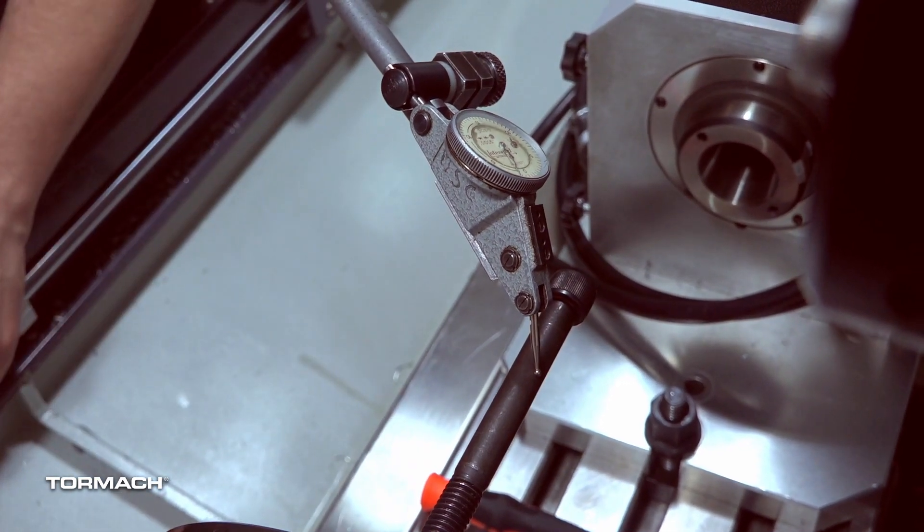You'll keep doing this process until you get your desired backlash in the rotary. The machine will run longer and last longer if you have it a little more backlash — maybe three thousandths. If you have it under five tenths of backlash, it will wear out the gears. So it's a fine line depending on your process.